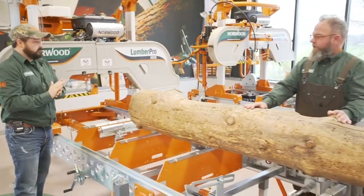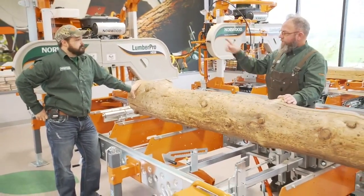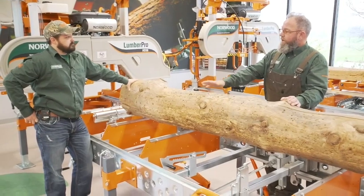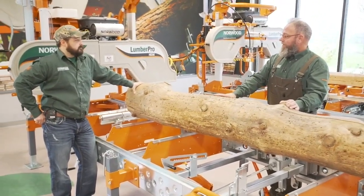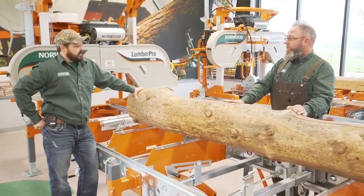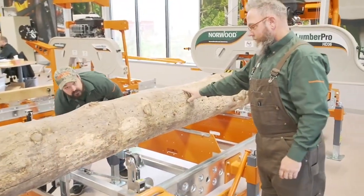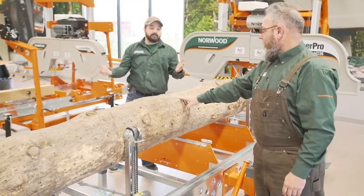By turning the handle I can lower or raise my log rests from one side, adjusting how tall they are on either side so you have solid pressure on the log. You're constantly adjusting because as your log shrinks, the rests have to come down as well. Without this you're constantly running around to get at the lever. There's also a benefit for operators with disabilities — I've sold this to a few guys who are handicapped but are still running the machine. They use the actuators so they can raise and lower the log rests from the same side without having to scoot around. Just by turning the handle it moves down or up, and with the flip of a lever locks it into place. There's one dial adjustment for each rest.